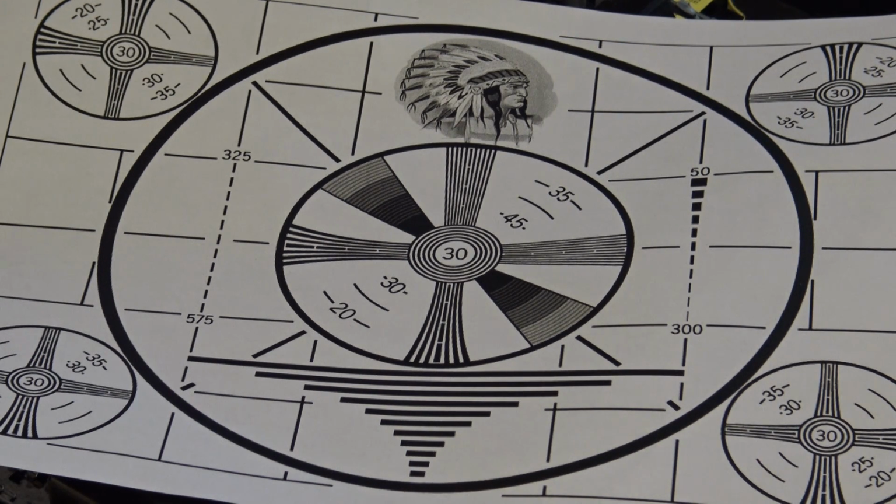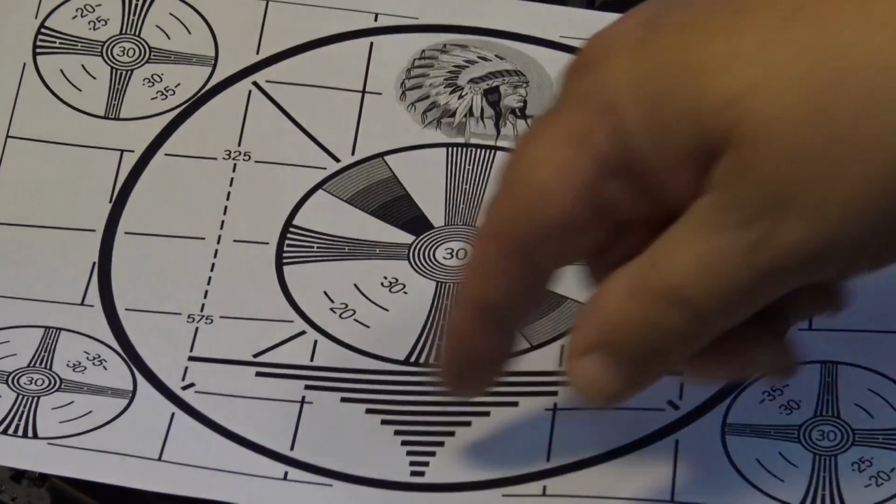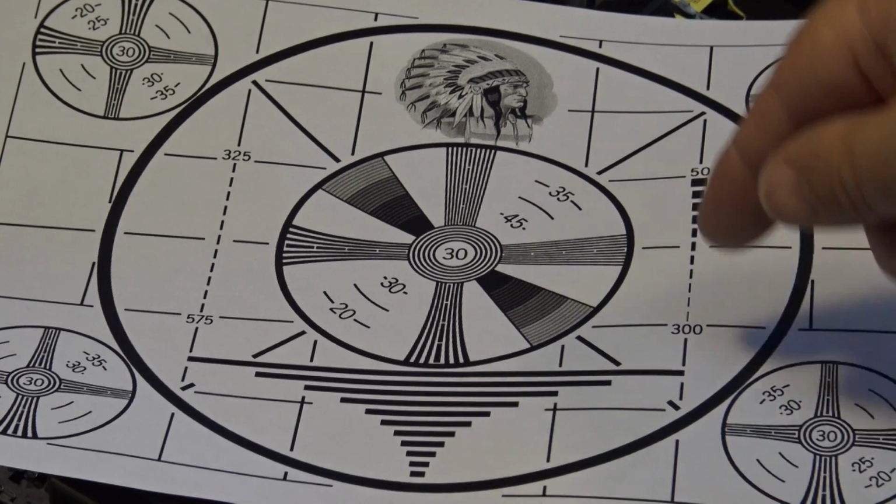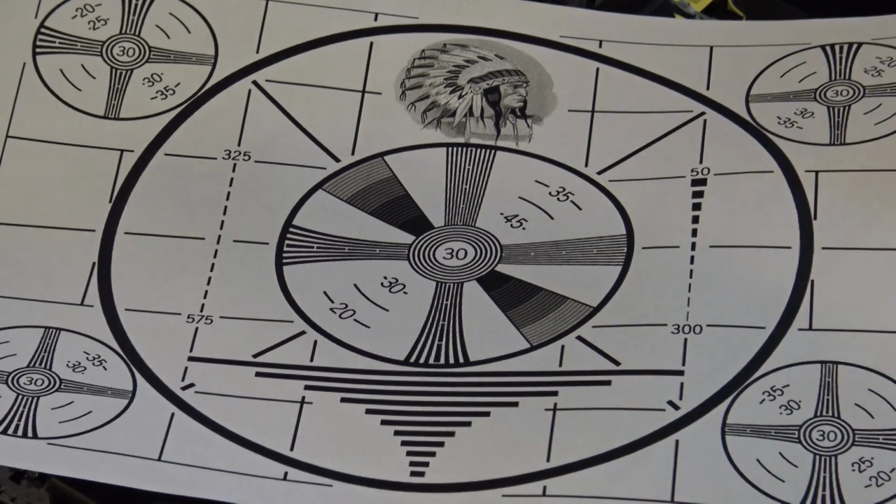And it just displayed a white raster, and he put a transparency card with this on it, and the light would shine through this transparency card, and there was a photomultiplier tube. It was what's called a flying spot scanner, and you kept the lid closed on this thing because if any light got into it, of course, it would affect the output. The photomultiplier tube generated the video signal that was then sent to an RF modulator that was hooked up to TVs that you were testing in the shop. That was for adjusting the size and the vertical linearity and the horizontal linearity, etc. And you could actually take this card out. You could take out this transparency, and you could put whatever you wanted.